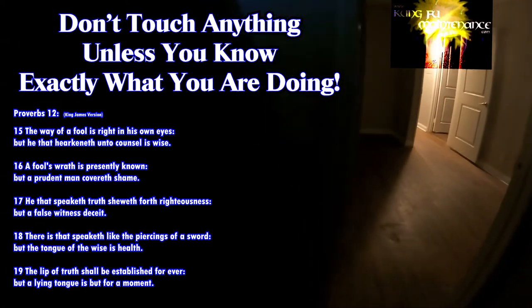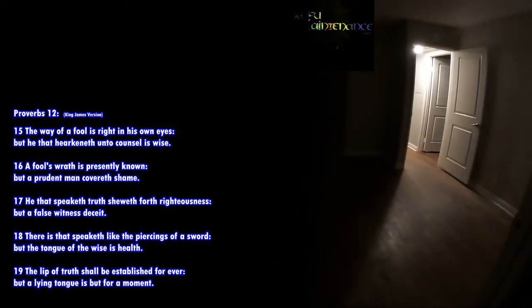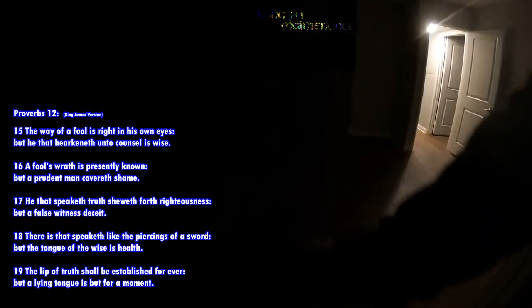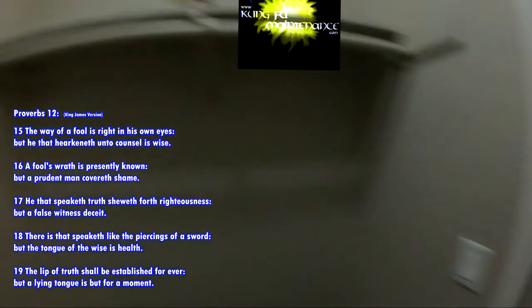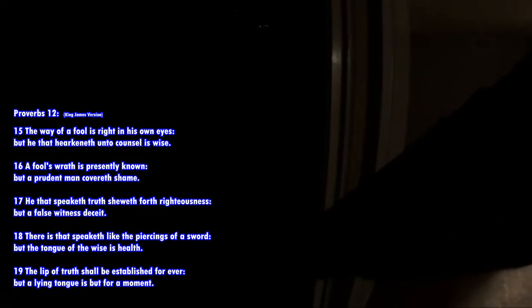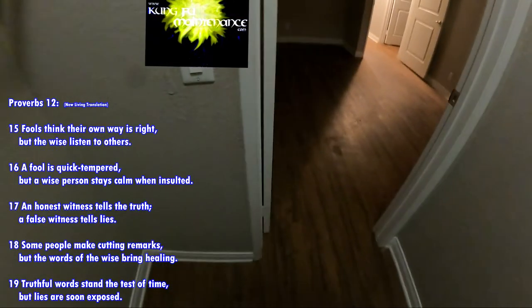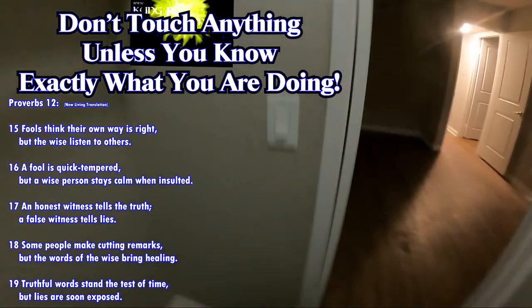All right, got a light not turning on. And the question is, is it the light or is it the rocker? Sometimes what you can do is... all right, definitely it's the rocker. See? Oh boy. Definitely the rocker. All right, so let's change this out.